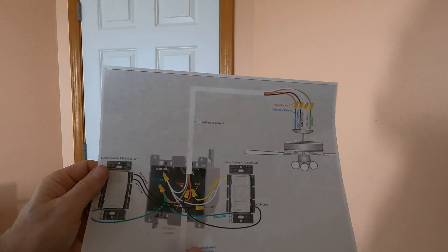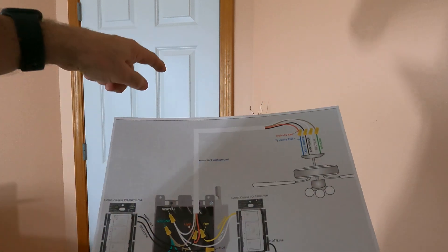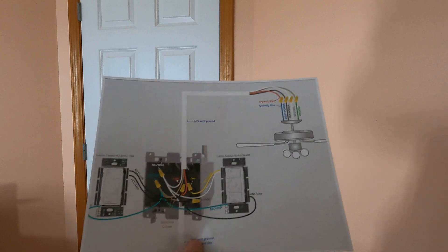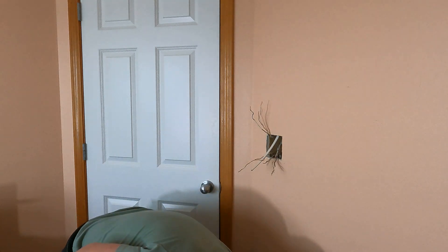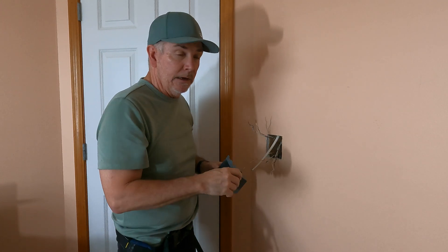Those were kind of a pain but finally got that all wired up and installed up there. Now we're on to the next part. Following the wiring diagram — the only difference is there is an accessory wire that was daisy-chained in, which I anticipated but wasn't sure about. We just need to wire that accessory wire into their corresponding colors — not a big deal. The very next step is to get the dual-gang box installed, feed the wires back through it, and put the box in the wall.